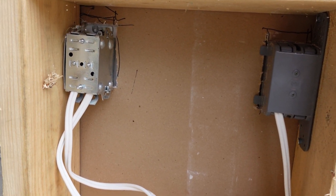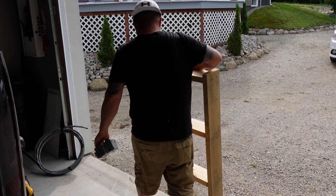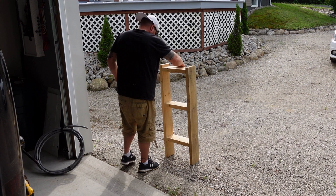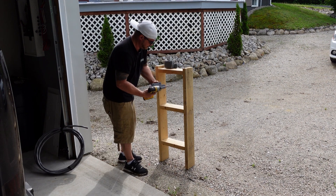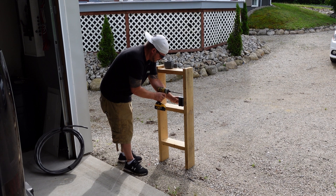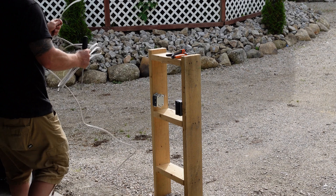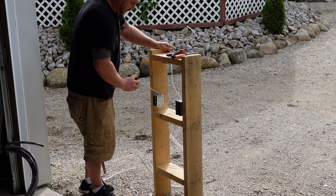We're going to use a metal box in this case to show you how much the metal box actually protects you. We're also going to do another video with a plastic box to show the downside of plastic boxes in case of an electrical fire. Safety first — I found the oldest piece of two-by-six construction I could in my attic. It's good and dry, so it should be a good source of ignition. I'm also going to mount a plastic box alongside a metal box to see if the plastic box adds to the ignition source and melts quicker.